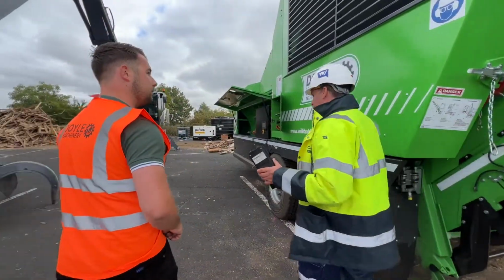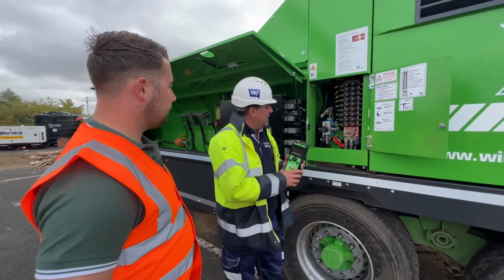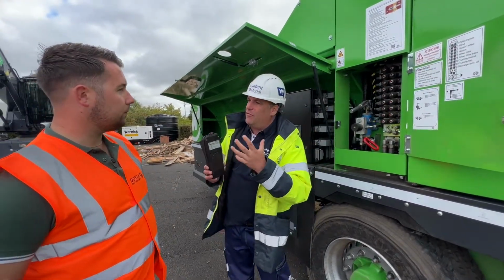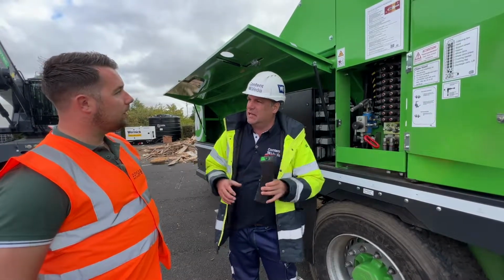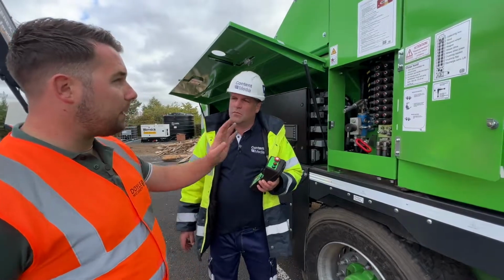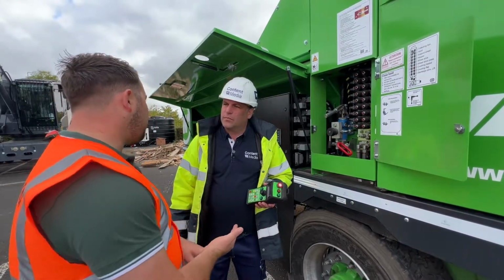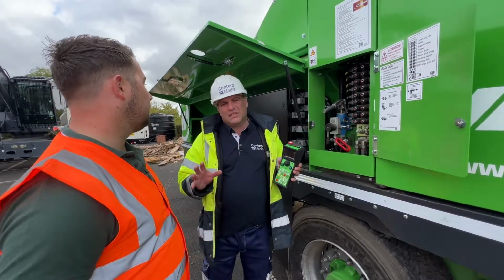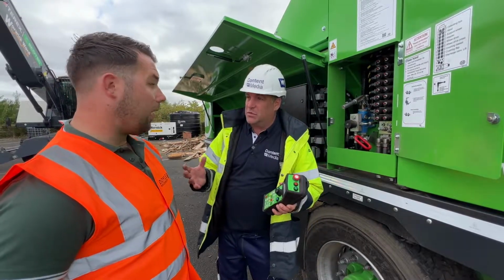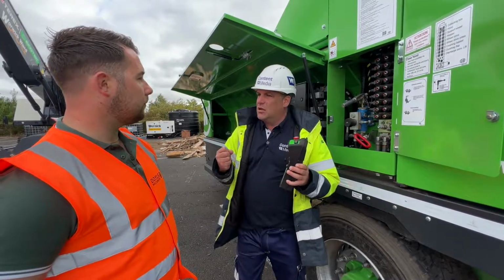Indeed. Moving on. Now, when we look at machines, obviously we've got to look at redundancy. Another safety feature here, which is really quite interesting for me, is this array here, where we have a manual pump to do all these tasks. Why have they put this in here? Because it seems to me to be a good idea. Again, maintenance: if you don't maybe have the controller or maybe the battery is dead and you need to do something quick, you have every single control here on the machine, and you can do it via hand pump. So if you're doing maintenance, it just means you can get in there and get it done quick. And this is all about speed, isn't it? Because these shredders are real workhorses on site, and you've got to maintain them properly, but you've got to do it safely as well. Absolutely. So turning off the engines and things like that, super important. And especially with a high-speed unit, they're really going to get a lot of workload going through them, aren't they?